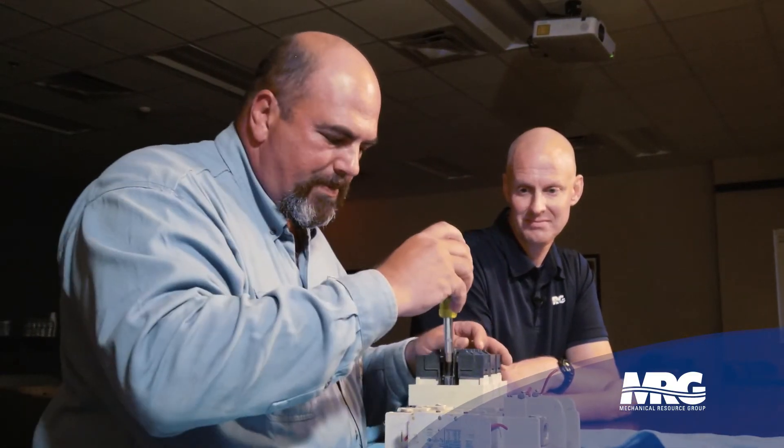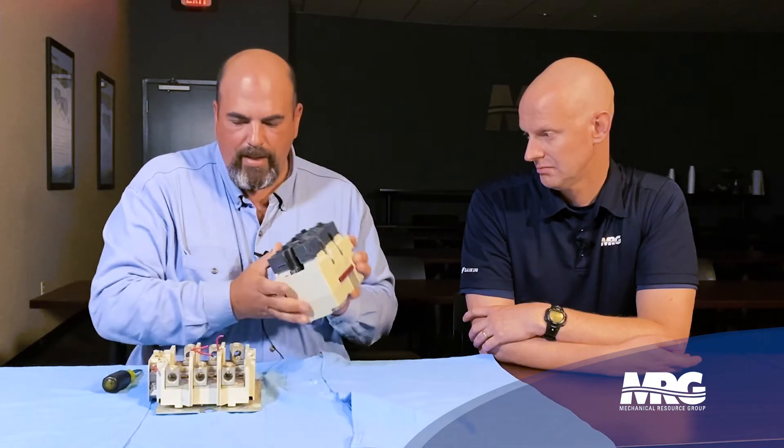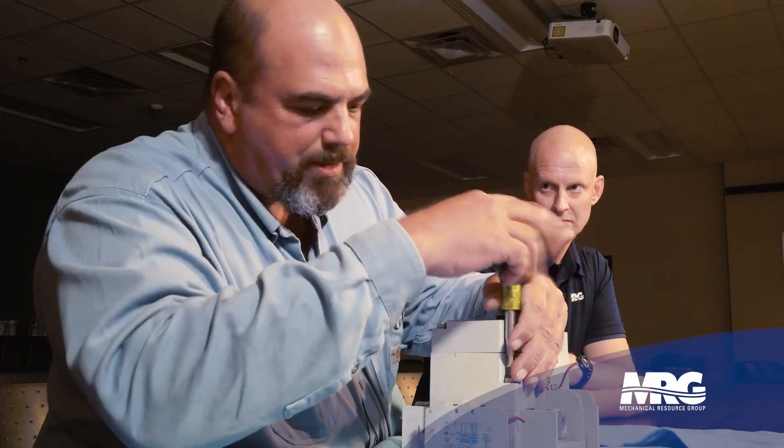Sometimes you have to play around to get those started. Always check where your coil is going to mate into — these are spring-loaded connections, just make sure they're not worn out. You can slide that back. If everything is put back correctly, you should be able to manually push the contactor in. Of course, you want this locked out electrically. You should have a nice, smooth operation. That's how you break down, inspect, and maintain an industrial contactor. Thanks, Matt.